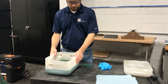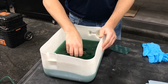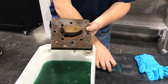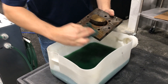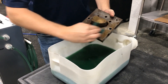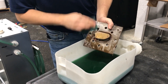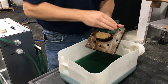We're back — it's been five or six minutes, so I'm going to pull this out, as that's the allotted test period I usually tell people to try. You can see some of the rust has started to come off, others not so much. I test it with a scotch-brite to see how much I can get off and determine if I need to lengthen the dip time. By doing this, I'm allowing all the material to drop back in so I can filter it out and keep reusing it, versus just spraying or brushing it on where you can't recapture it.